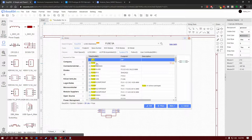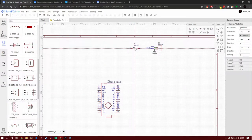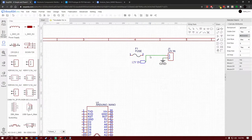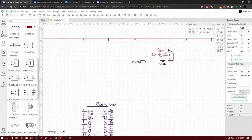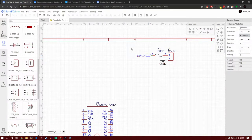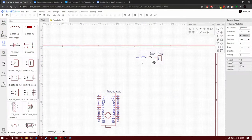I want to clarify that AC's ground and the 12-volt and 5-volt ground are going to be separate. I'm going to select a fuse and name it a 5-amp fuse. Since we're not worrying about the PCB part in this video, footprints aren't that important. I'll put the fuse in line with the 12-volt as mentioned earlier. I'm using a fused plug for the AC and a power supply with internal short-circuit protection for DC. If you follow my circuit exactly, you have nothing to worry about, but fuses are important if you experiment.